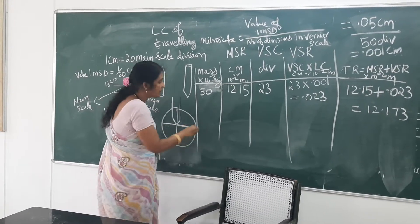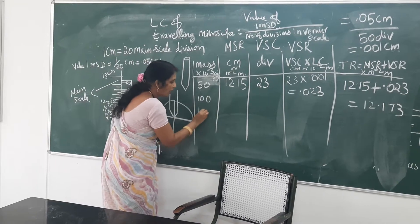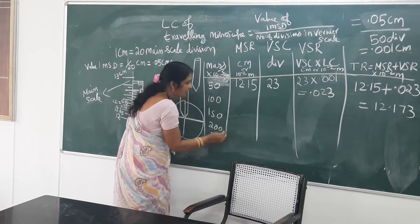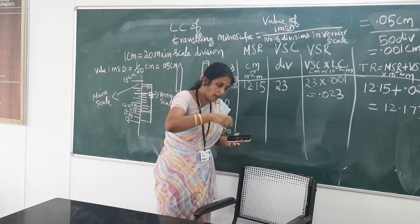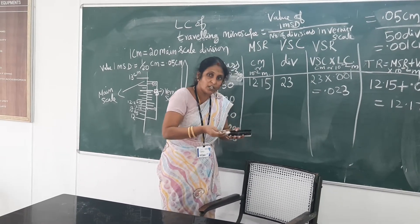What we have to do is increase the load — 50, 100 on both sides, then 150, 200 — increasing in 50g steps. You have to raise the load and each time the pin tip at the beam will elevate as each load is added.